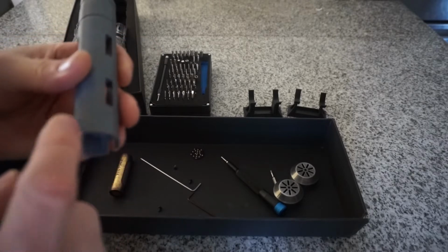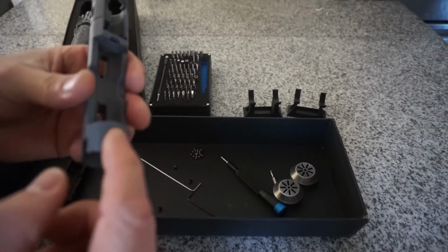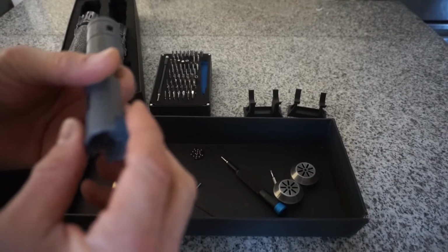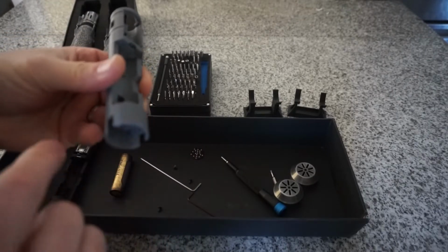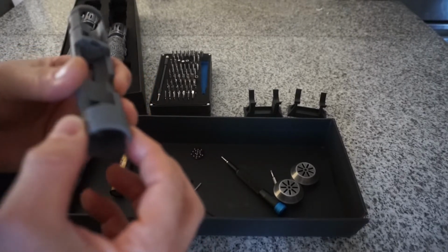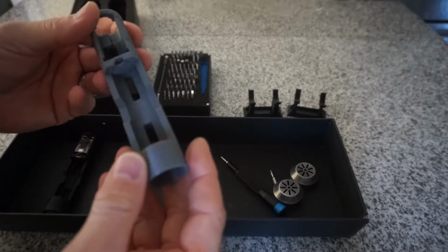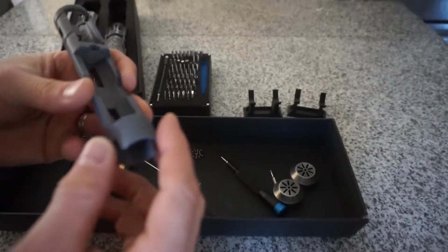So I'll take a Dremel drum wheel and just get rid of that edge. I don't know if you can see it. I can see it. There'd be a little bit of a lip on the outside as well as the inside. I'll definitely sand the outside. I don't always sand the inside because sometimes that helps keep the speaker held in place. But you test fit and you sand as necessary, and I'll definitely hit that edge there.